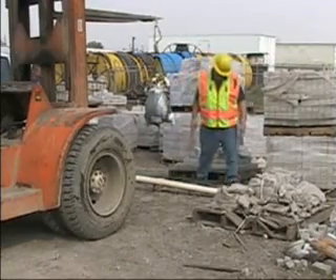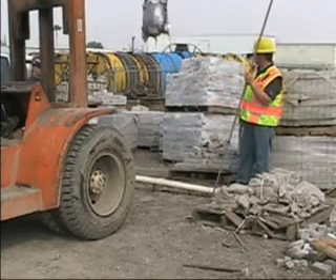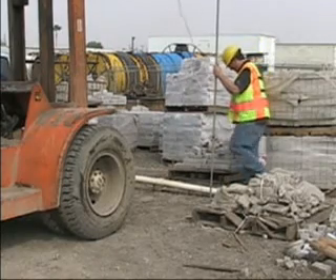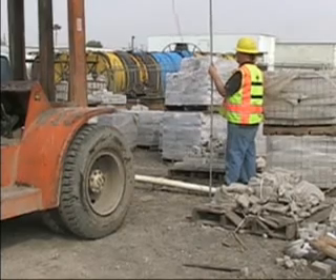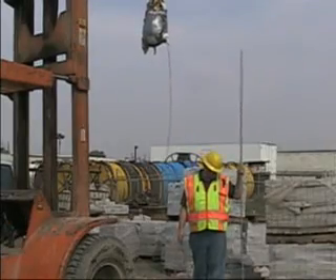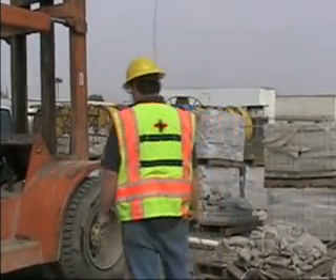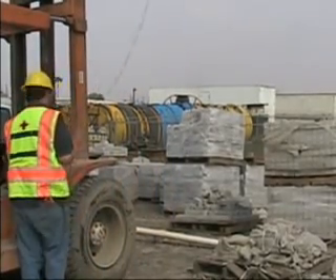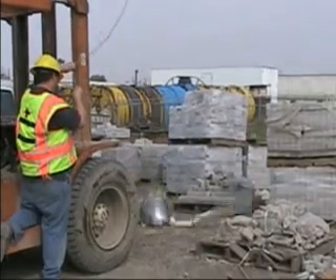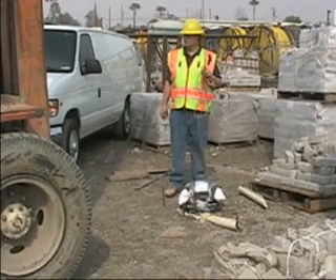In this test we're taking a load that's approximately 200 pounds. Three pieces of number four rebar have been pounded into the ground with six inches protruding, and a piece of three-inch PVC schedule 40 has been slotted and laid over to simulate a trough. This is a common field practice — they're measuring to make sure this is suspended ten feet over the top of the trough, and we'll be doing the drop test shortly.